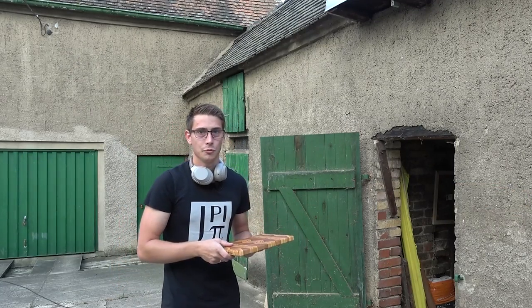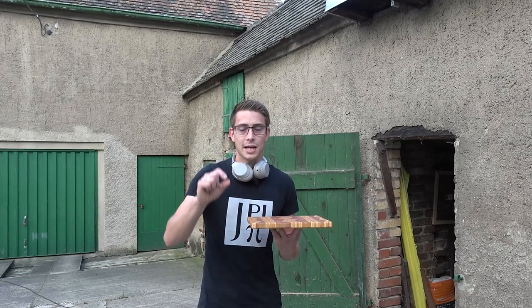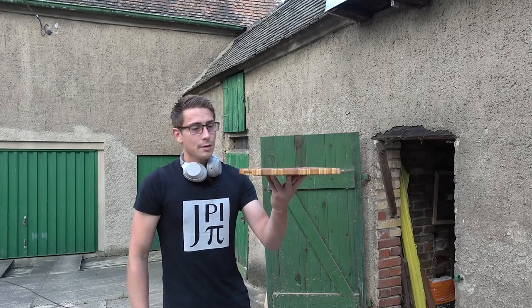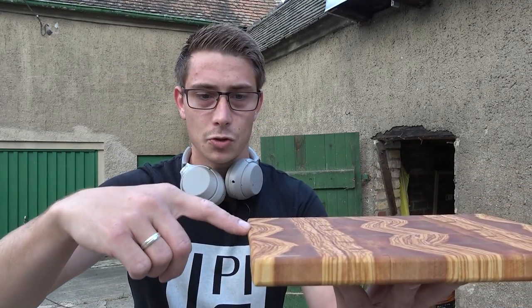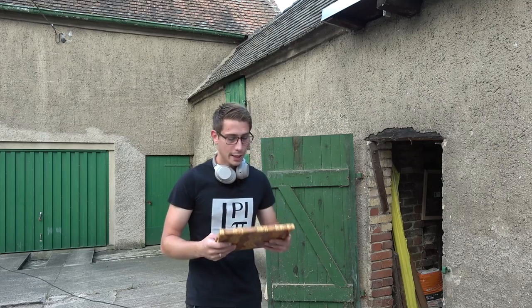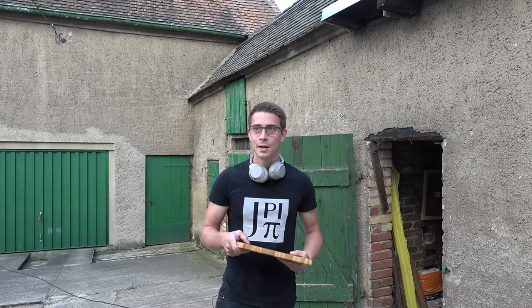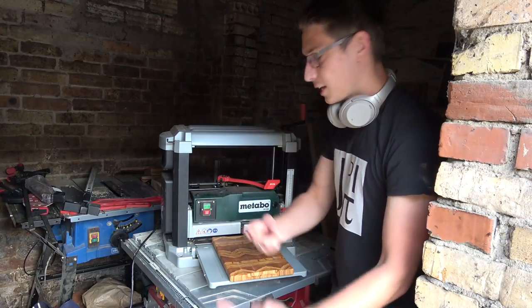To counteract this problem I thought about two things. On the one hand I want to reduce the load on my blades in my planer - I'm going to take very very tiny steps downwards, maybe only taking off like 1/20th of a millimeter at a time. Also, one good thing about my cutting board is that I already chamfered it, meaning at the last part where the blades are going to hit, I hopefully won't get any tearout on the corners and edges. This is what we are going to try out today - it's a first timer for me. If it works out, then the myth of 'don't let end grain cutting boards run through your planer' is basically busted. Fingers crossed!